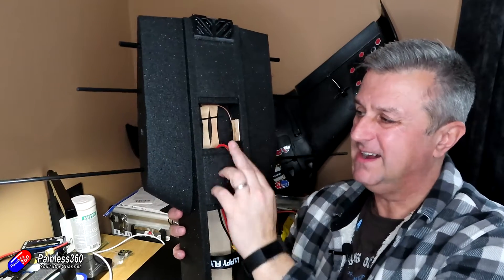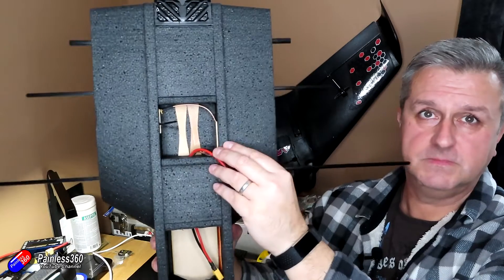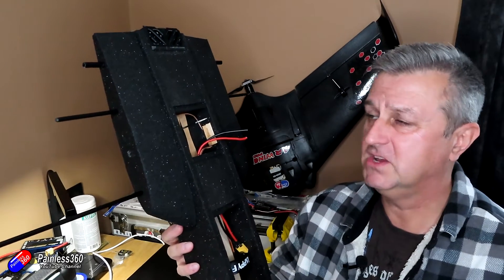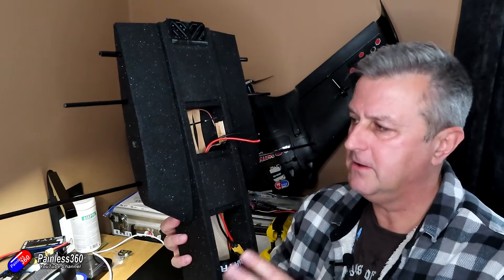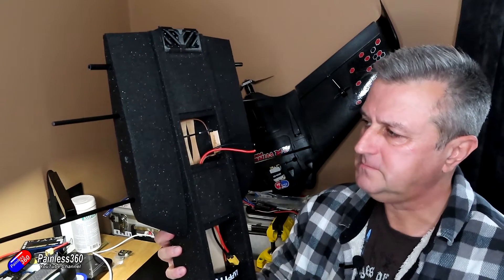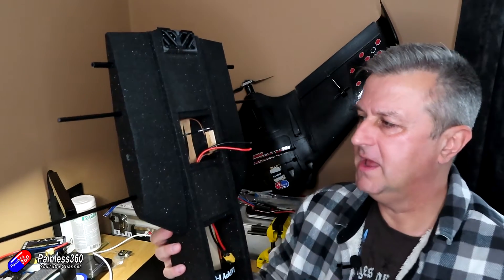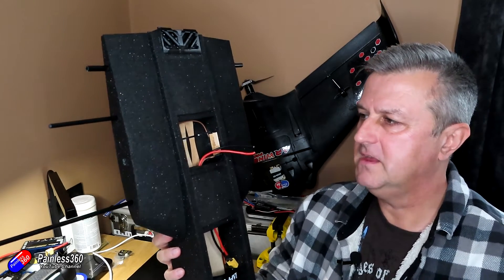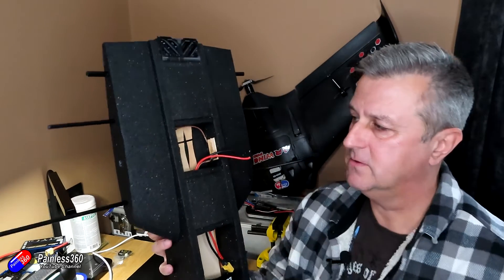The rest of the electronics don't have a ton of room. I've put in some ice lolly sticks — Magnum sticks for those in the UK. In the summertime when you're having ice creams, keep the sticks because they come in immensely useful for stuff like this. I use double-sided foam to mount a lot of things, and cable ties as well to make sure things won't pop off. There's really only one way everything fits: flight controller in the middle as far forward as possible, video transmitter on the left, receiver on the right, and the ESC out in the wind.